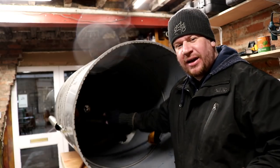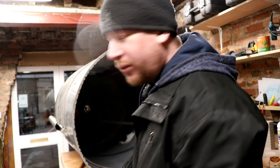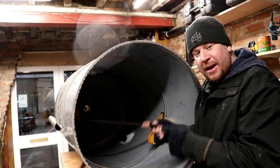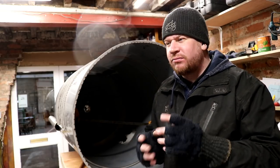I've clamped the backing on the inside. What we're going to do is start to weld on the cooling jacket on the other side. We'll see if this backing is sufficient enough to prevent any coking coming through the stainless. I'll just do a little run of maybe about six inches or so and we'll have a look.